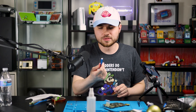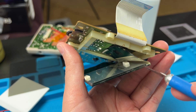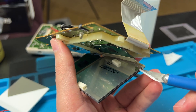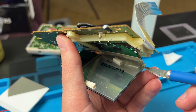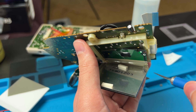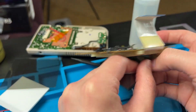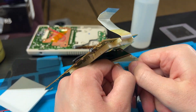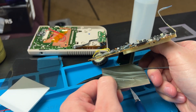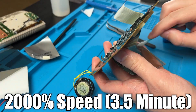If you have a box cutter or preferably a craft knife, we're going to remove this reflector here. As you can see, there's kind of two layers of glass — we don't want to remove either of those sheets of glass. So we're going to try very carefully to get in just like that. Right here you can see a bit of a brown-yellow layer — that's the polarizer. This is the reflector. That's the polarizer. You want to get the polarizer as well. Be very careful not to poke your craft knife through this ribbon cable on the side. We just want to get this up enough that we can grab it with our fingers or tweezers and pull it up. I'm actually spraying some IPA in there just to hopefully loosen up the glue. There we go — and now it looks like this. Now we're just going to get some IPA in there, clean up all that residue, make sure it's nice and clean.